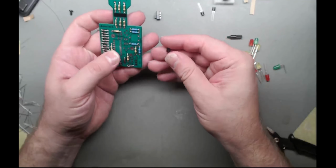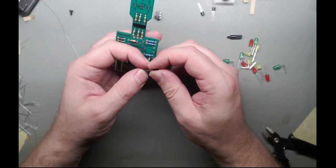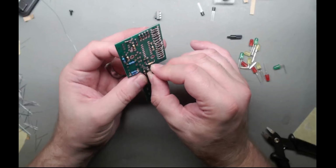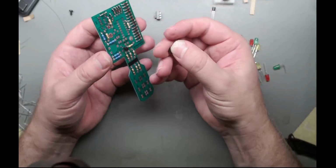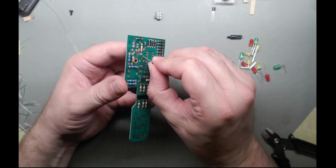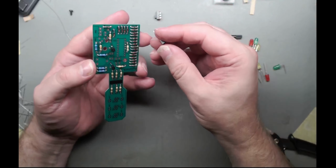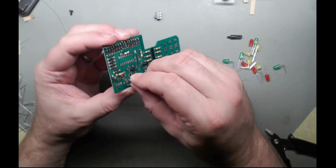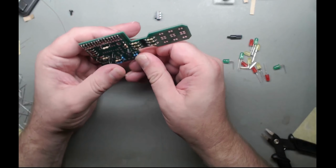Well, okay, so this is a 547. 547, according to that list, is a T1 or T2. Sticking into a T1. Five, four, seven, so that must be T2. There we go, thank you very much. Now, 557. T3. So those two are the oscillator. They're switching the chip on and off.